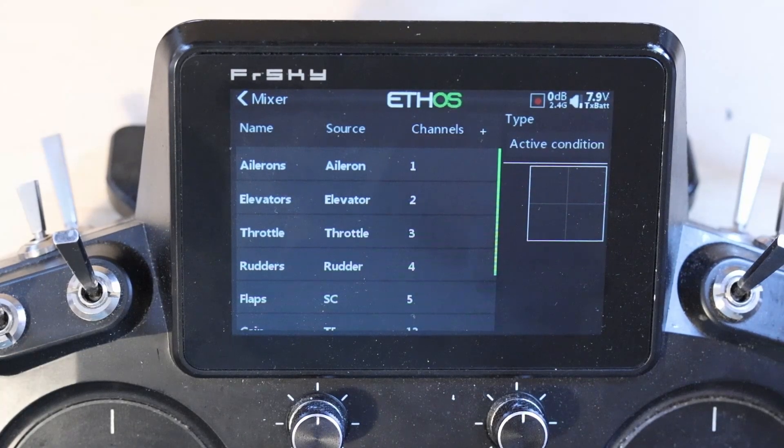The reason for this is very simple: when the RSSI dropped below the 0 point — and it's encoded from minus 100 to plus 100, so 0 is about an RSSI of 50 — the RSSI on channel 16 dropped below 0 and triggered panic. So what is the solution for this? In the firmware, what FrSky has done is removed the panic mode.